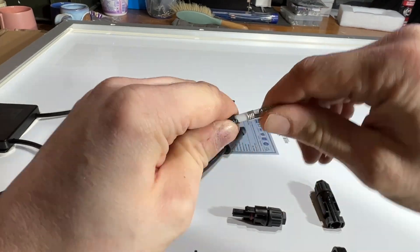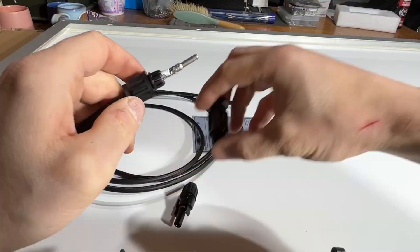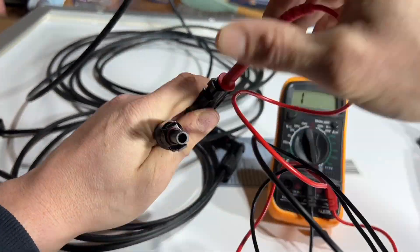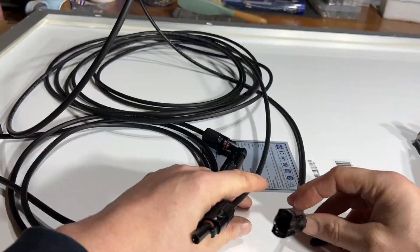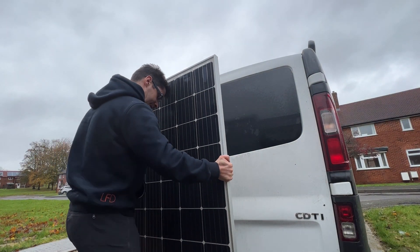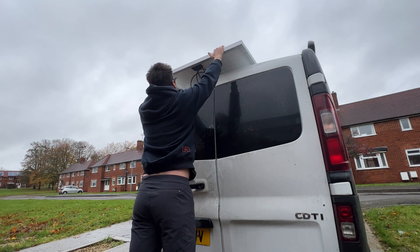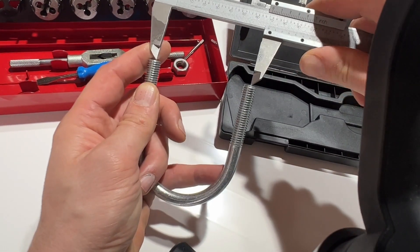It's solar panel time — just a case of stripping connectors and making these MC4 connectors. I actually got the wrong one, had to buy another one and get it sorted, but I checked the continuity just to make sure. Then it was a case of just fitting it — I went outside and put it on the roof, measured it up so I knew where to draw the holes, and was good to go.